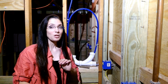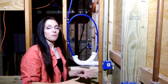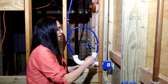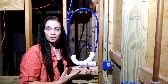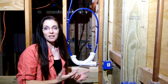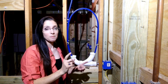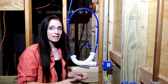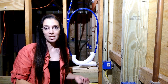Here's the magic behind what you just saw outside. Watch as you can see we're servicing this line outside and it contracts, then the PEX re-expands to its original loop. So this could be considered a PEX expansion loop as well. We're using specifically Uponor's PEX-A because, of all the different kinds of PEX, PEX-A is the most flexible of PEX products out there.